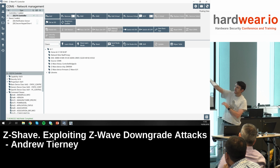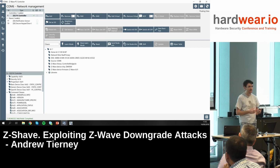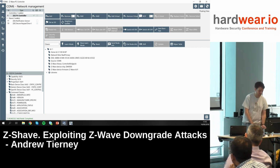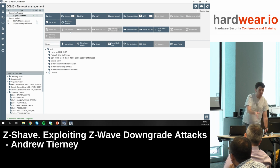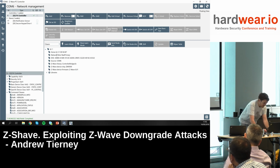You can see at the top there, S0 secure keypad lock. So we downgraded that pairing. You'd notice I didn't have to enter the device-specific key, I didn't have to answer any of those questions, but I haven't done anything differently. Now the thing is, the lock's not mentioned this. The lock's not got a red LED on it saying, I've paired with S0 security, run S2. It's got one LED and a buzzer on it, that's it. There's no user interface, so it's really difficult for them to do that.